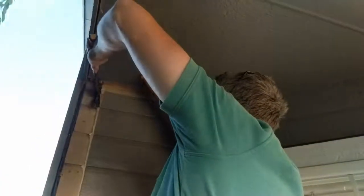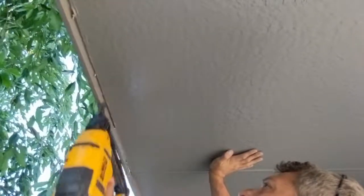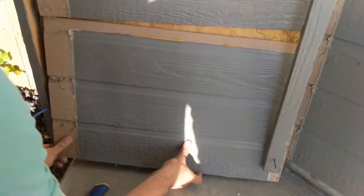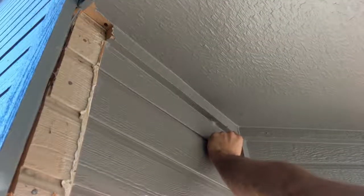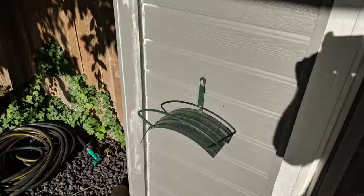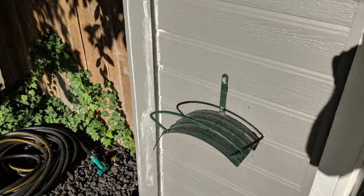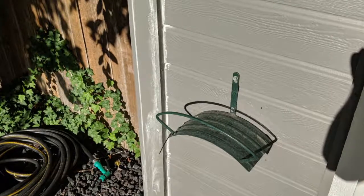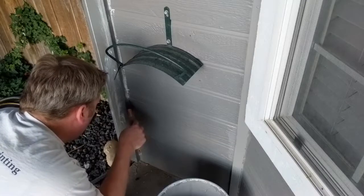In this video, I add a couple extra nails using a battery powered 16 gauge nail gun. Now you want to put the siding back on following the nail pattern, followed by your soffit trim and then finally your corner board, making sure they are as snug as possible. Caulk along the same edge that you had previously cut. At this point, you can touch up to match with the existing house color.